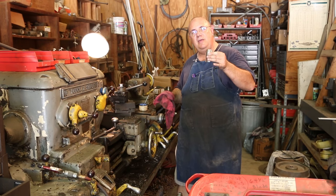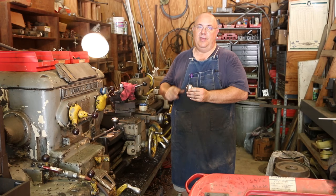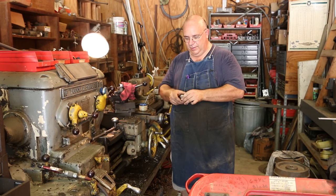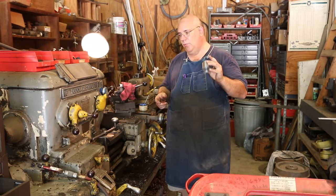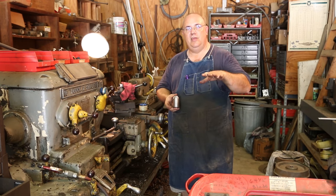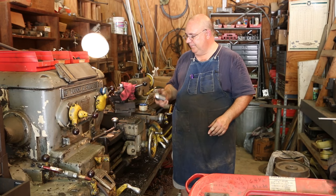What I want to do is put these under those screws, and I want to do that for two reasons. Number one, with a leveling screw, you've got just a very small area contacting the floor — just the tip of that screw — because they're kind of pointed on the ends, and that's putting a lot of weight in a very small area. With this, I'm using some two-inch stock, so basically I'm spreading that weight out over a much larger surface area on my floor, which will give me more support. The second thing is I'm making them about three inches tall, which will help raise the lathe up about three inches higher off the floor, since right now it's just a little bit short to be comfortable for me to use. So kind of dual purpose.